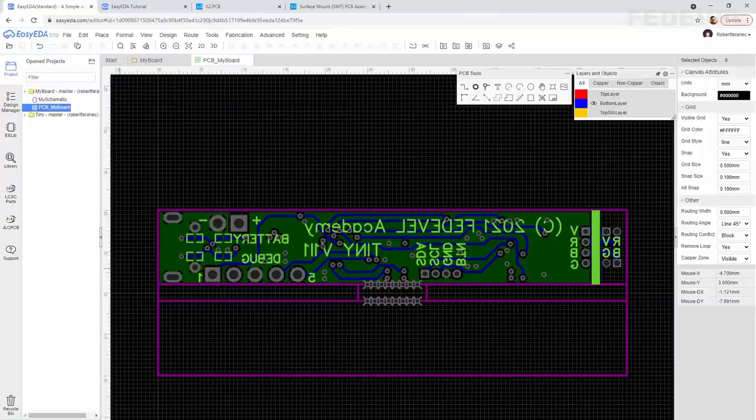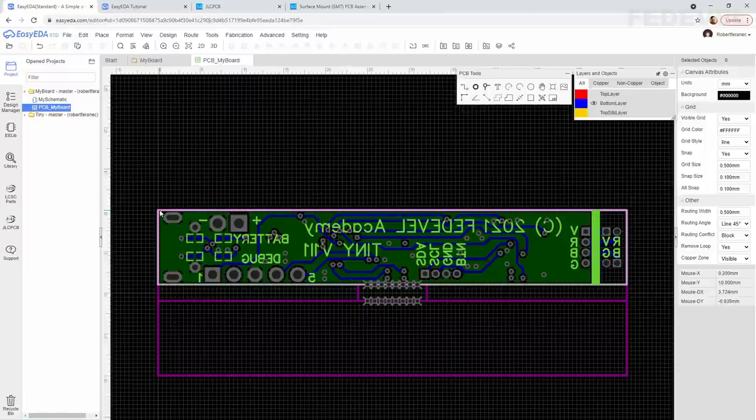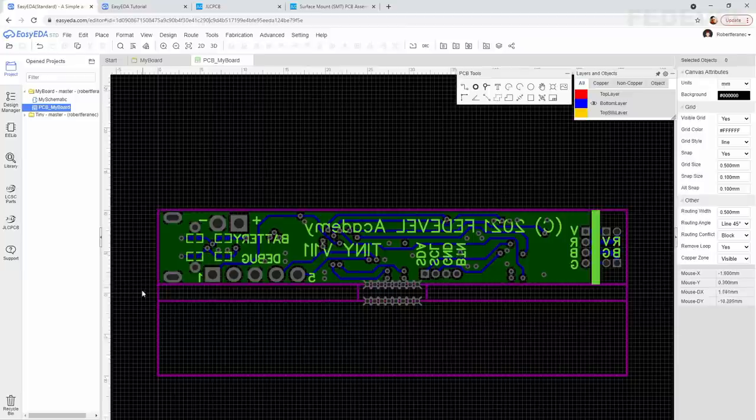When we created a panel of our PCB, we made the PCB bigger. So this is 9 millimeters. This is 2 millimeters. That's 11. And this is another 9 millimeters. So together, this is 20 millimeters by 56 millimeters. It means now JLC PCB can manufacture and assemble this board. And also by creating this panel, we will actually be getting, instead of one PCB, two PCBs.